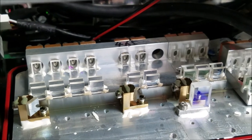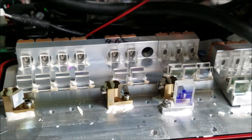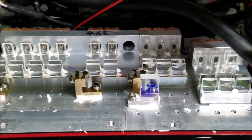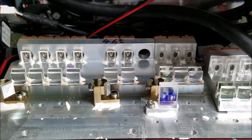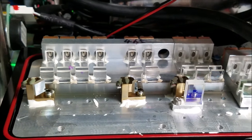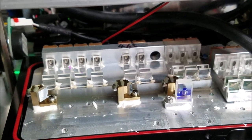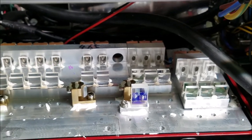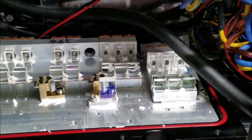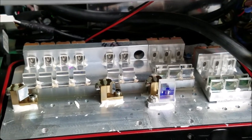So that's my thought on it, which is, you know, it's a cheaper way of doing things, but I guess it works okay enough. Usually on higher end lasers, you'll see proper collimating lenses inside of lens carriers, and then you'll also see the beam correction done with something like anamorphic prisms, which is a little bit more efficient and a little bit more optimal instead of using the beam correcting lenses like this. But yeah, that's one expense saving measure they've taken.